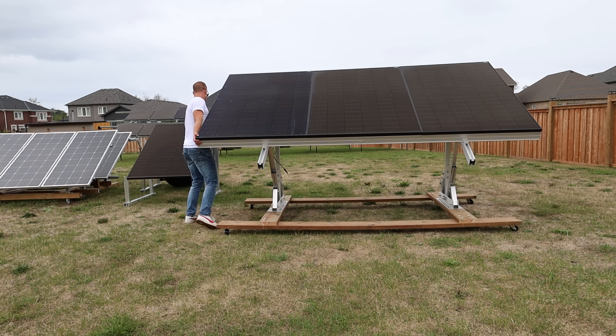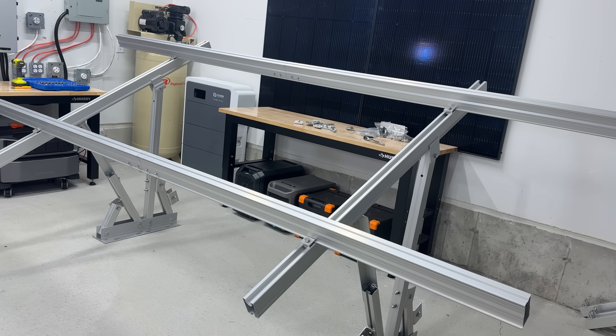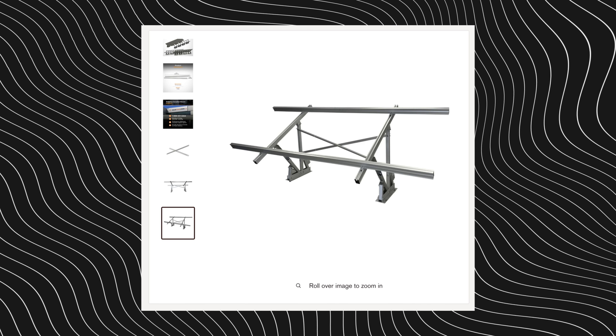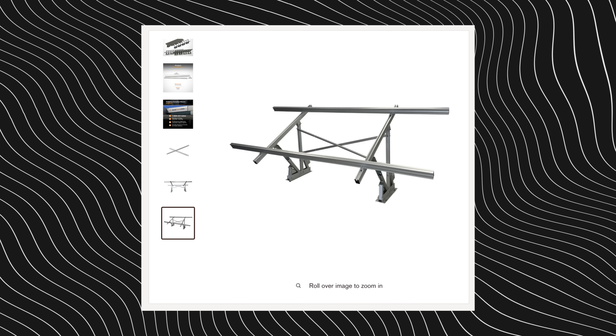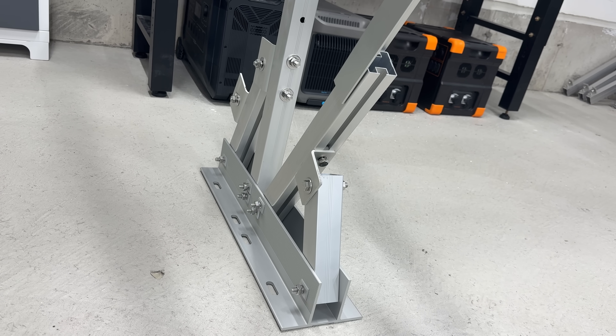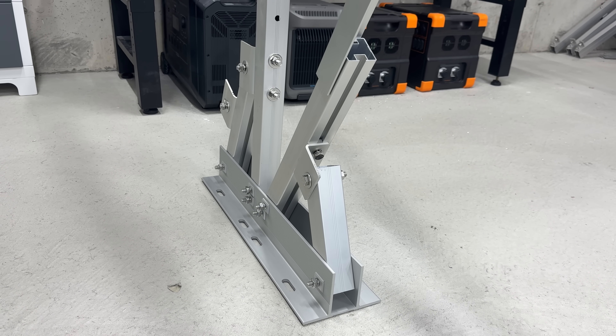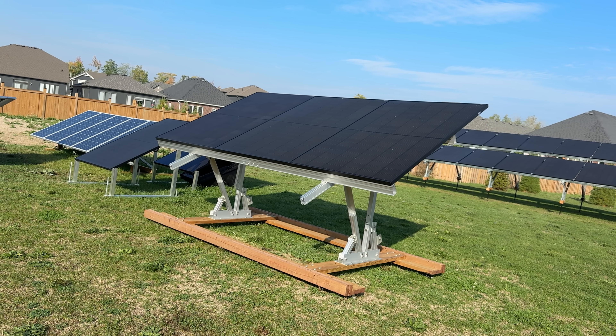So this thing's actually really light. It weighs 38.6 pounds, which is not a whole lot. If you add the Hurricane Kit to it, which is just some extra bracing that's an available option, that's 44 pounds. It has a snow load of 860 pounds per column and can do wind speeds of up to 105 miles per hour.